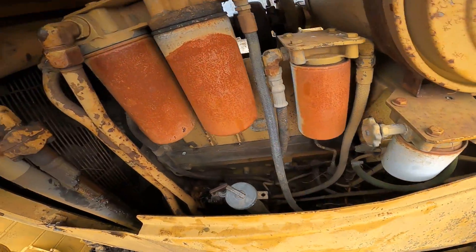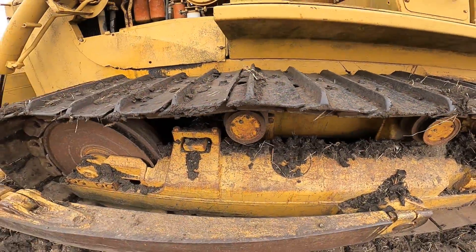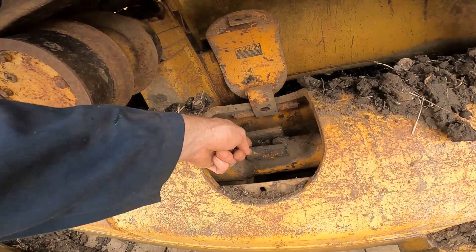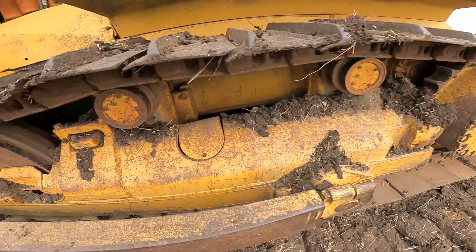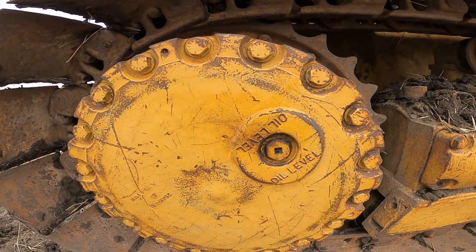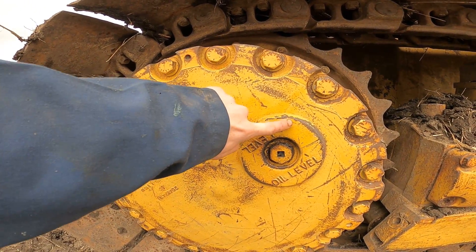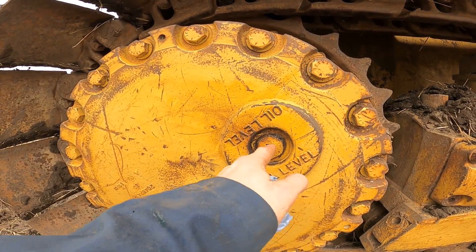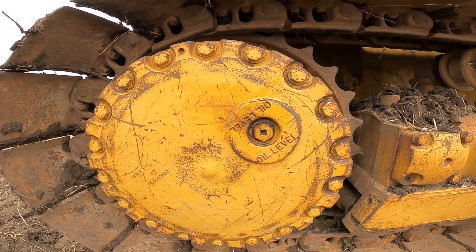You want to check your oil - that's where your oil goes. Those are fuel filters I believe. Then if you want to tighten up the tracks, you just lift up that cover and then grease that right there, and that'll tighten up your tracks. By adding grease it pushes out the piston, which then tightens up your tracks. Another really important thing is you're going to want to get the machine level - completely level - and then use a ratchet, stick the end in there to take this off, and then fill it up and make sure it's full with oil.